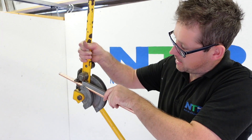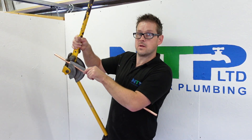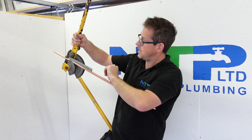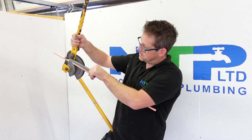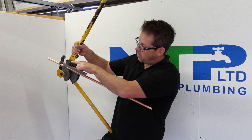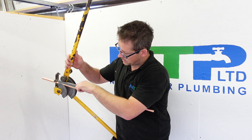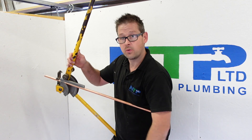You then get it and put it in place. Now I'm using my hip — you can just about see — I'm using my hip with the arm down here just to help steady it. I've got my hand here and I've just put the guide in place. Now once I let the roller — this is called the roller — hold that in place, the roller, the guide and the pipe are pressed and sandwiched against the former just there.